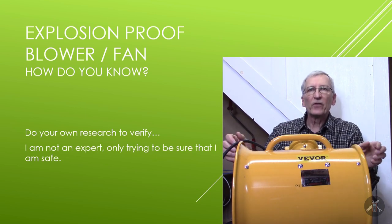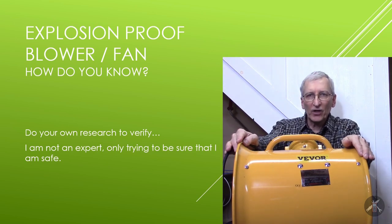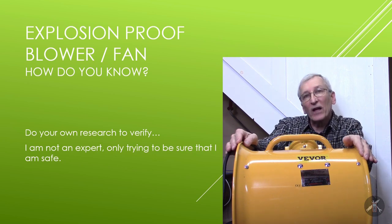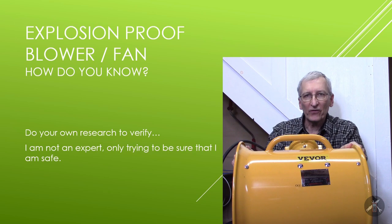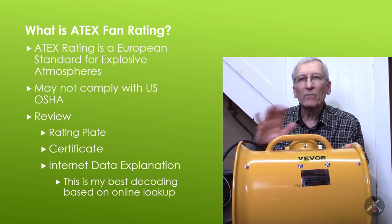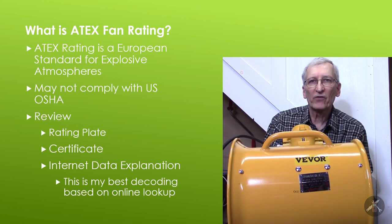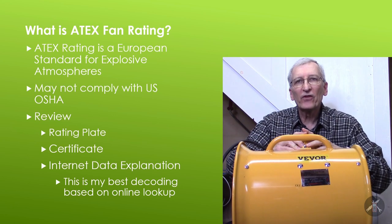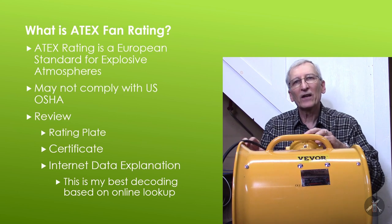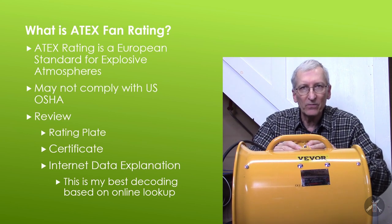One of the things I found in looking is that you can go to certain places and buy fans that look just like this that are not rated explosion proof and definitely would not be. They're not advertised as explosion proof, but they look almost the same — it could be deceiving. So how would you know? From a superficial standpoint, this one has a big switch up on top that's all sealed up, not a switch with an exposed handle. This one looks like it's gasketed, for example, to keep gases out of it.